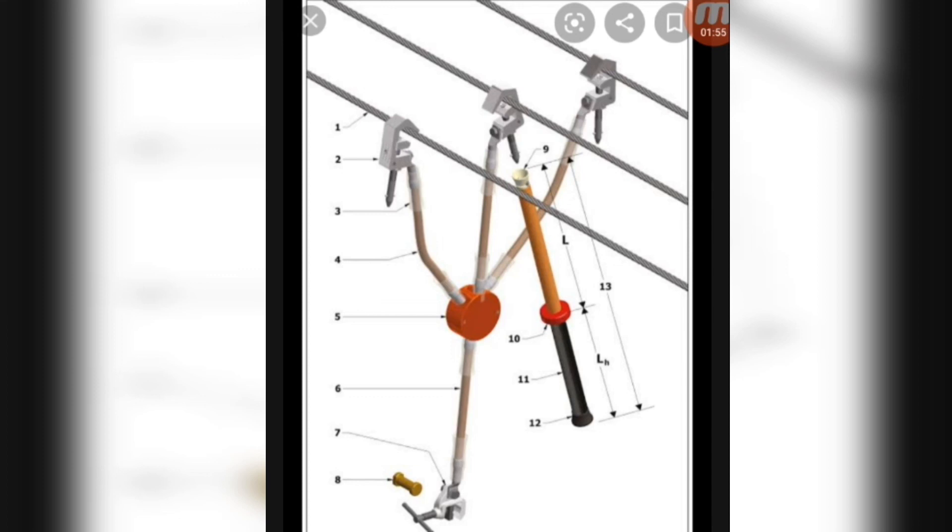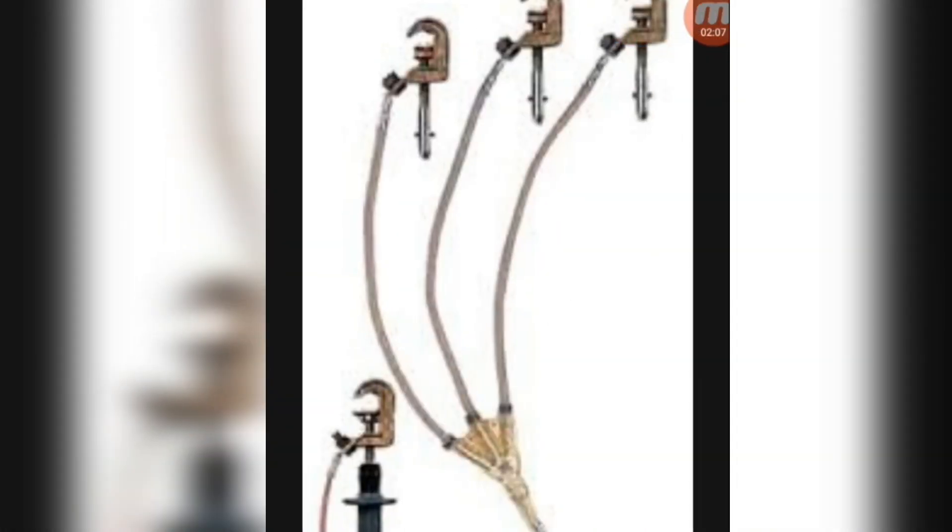After the short and ground is installed, you will work on the task you have been given. If any jumper is loose or any wire is broken, you will repair it in that area. Then again you check the line. The final rule of line isolation is that everyone must remove the short and ground and then check the supply. Thanks for watching. Please subscribe and comment below whether the video was properly explained, or if you require any other video, comment below and I will provide it as soon as possible.